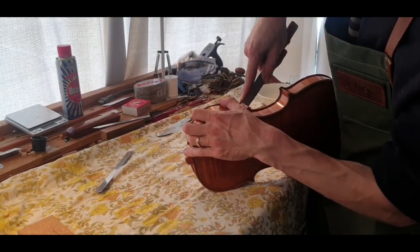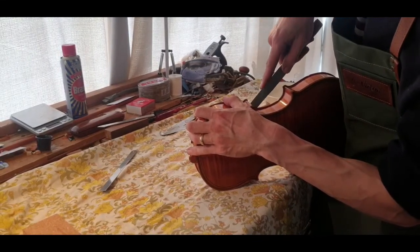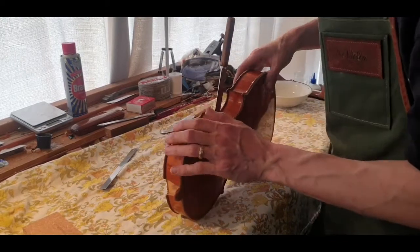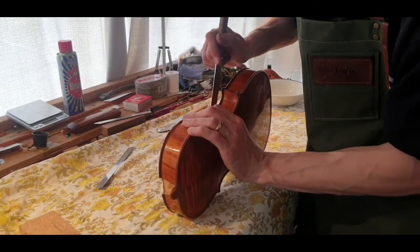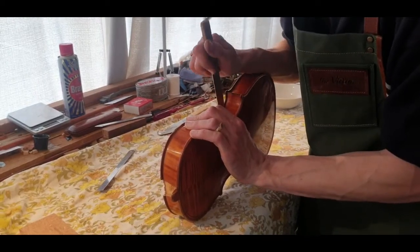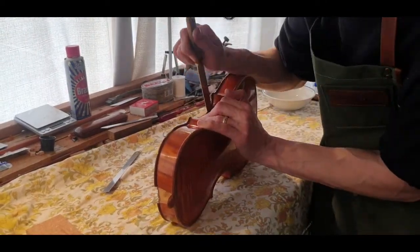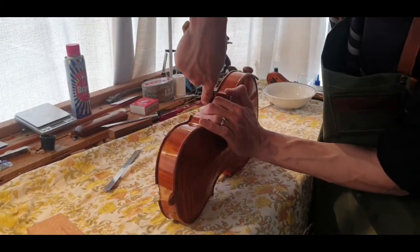There's a lot of it that's a feel thing. You can feel the glue letting go and cracking - you can hear it cracking as you go along. And that's the nature of the hide glue to shear under pressure rather than breaking the timber grain. The glue itself is quite brittle. With your PVA glues and your modern wood glues they're quite stringy especially when they're dry - they're almost sort of stretchy and they cling to the fibres of the wood.